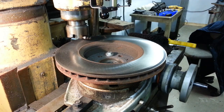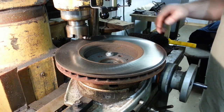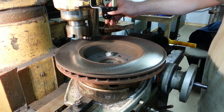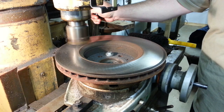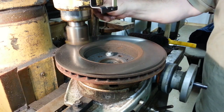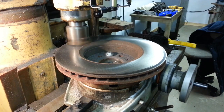Okay, so time for the finish pass. I just kind of checked everything over real quick and turned on my little DRO here so I have a repeatable stop. Make sure everything is clear. Okay, bring this down to zero, and then it's in two thousandths.